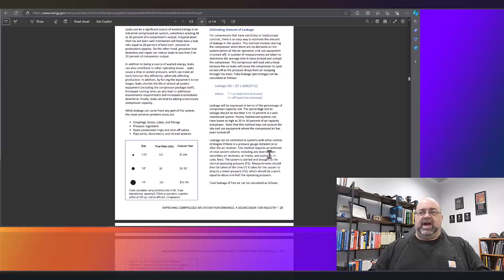It was so bad that the end user had to bypass their circuit breakers in order to get the compressors to run to the points where they were supposed to run in order to keep production running, instead of fixing it, but also instead of looking through and identifying compressed air related issues. That can be everything from compressed air pressure to evaluating leaks.